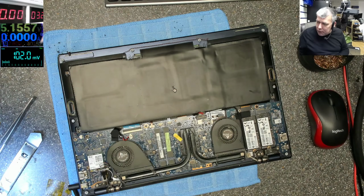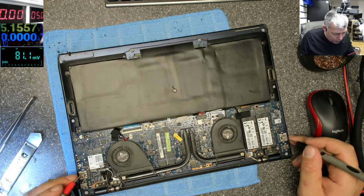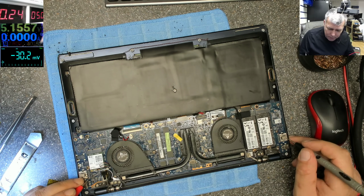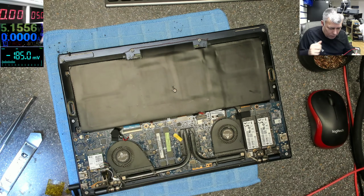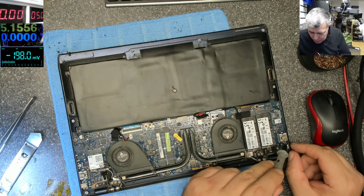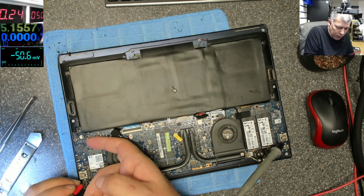Okay. Let's leave the charger inside. Let's come with 5 volts. On the power supply we have 5 volts. Ground. Plus exactly where that capacitor exploded. And it's taking 250 milliamps, which is not unusual. Let's unplug the charger, let's unplug the battery, and let's play now with the power supply. Let me just stick the ground there. 250 milliamps.